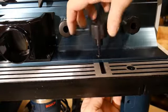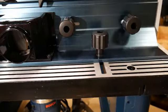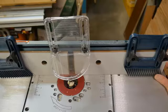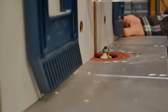The fence is secured with bolts with large nuts that can be tightened by hand. There's some micro-adjustment capability by loosening and moving one end at a time, so the fence only moves half as much in the middle by the bit.